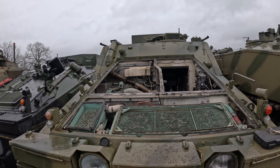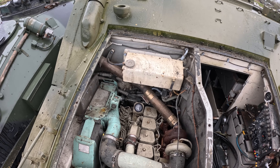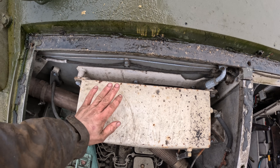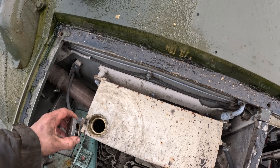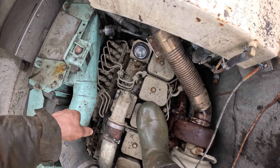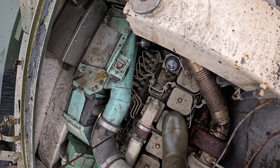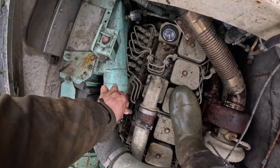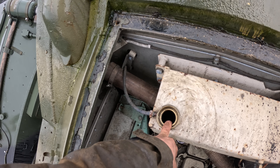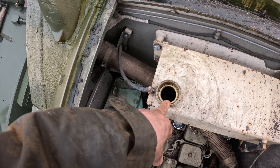If I remember correctly, it is quite a high-hour engine - 4,000 hours - but still not a lot. I think it's basically been cooked. If you look in there, it's just full of oil, and this will probably have a load of water in it. I might try and get it running just to see if I'm getting pressure. That'll tell me if it's the oil cooler that's failed, or if it's a suspected head gasket, cracked head, or something warped.